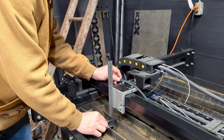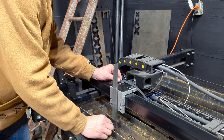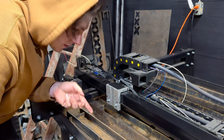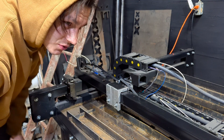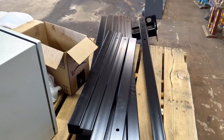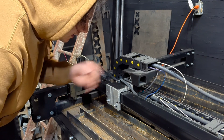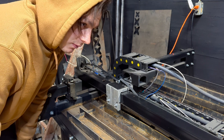Back outside, I got that pretty much squared off to the slats and the mounting surface — it's probably like a 64th out of square. I think that's pretty close. If you guys are making this for the first time, definitely do not paint the gantry or where the rails are, because I even powder coated this with an industrial-grade powder coat and it's starting to flake off and get caught in the bearings.